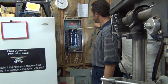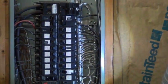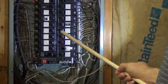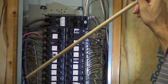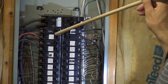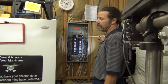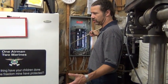Now, just a quick breakdown of what we're looking at. The average house is wired for 240 volts. There are two 120-volt buses that singularly make 120 volts, and when crossed over make 240 volts. You'll notice if you look in here you'll see two black wires. You'll also notice that I'm using a wooden dowel to point with — keep your fingers away from the panel and away from wiring when it's energized. Always assume the wire is carrying current until you've absolutely proven otherwise. There are multimeters and sensors you can buy at your home improvement store that can tell you whether a wire is live.